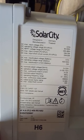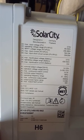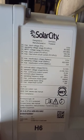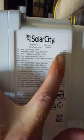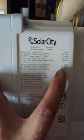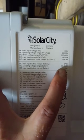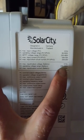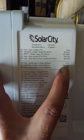Solar panels, same thing. It's got two MPPT charge controllers built into this inverter. You can put in 500 volts from the solar panels. And look at that range - you get good range between 85 volts from the panels all the way up to 550. I looked at the chart and it was pretty efficient no matter what voltage you used, but definitely better with the higher voltage.